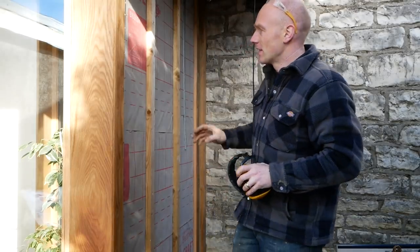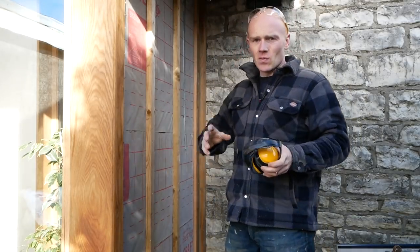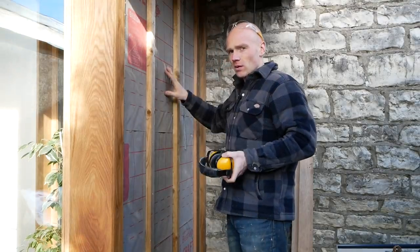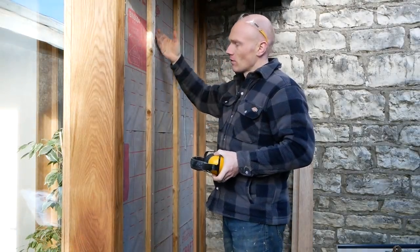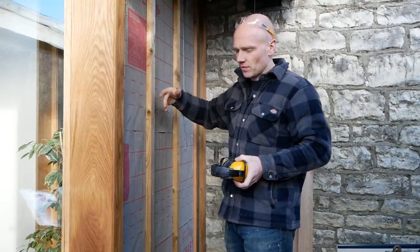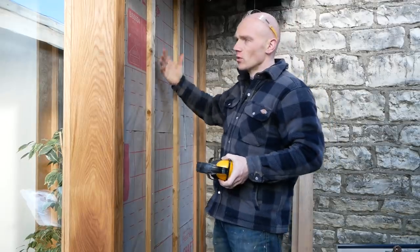Right, so finally getting around to getting this cladding on. You have to forgive any wind noise, road noise, everything. It's all going on today. Battens went on when we built the porch, the membrane's on, and we've got a space here, which is like our cavity breather space, for just keeping the wood dry behind.